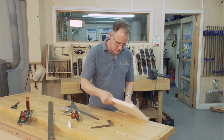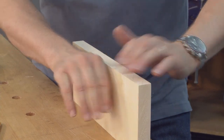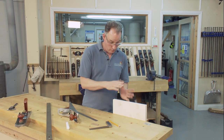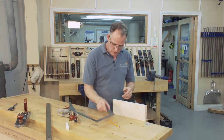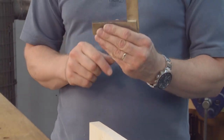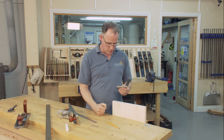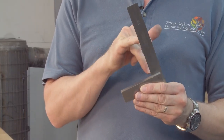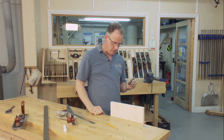So I'm going to set this up in the vice — that's now the right direction for me to plane and push those fibres down. I also need to see how square this edge is to my face side. I always use engineer's squares; they stay accurate for years and years. I don't find that wooden carpenter squares stay accurate for very long at all. I need to reference the stock of my square against my face side — that's always our reference or datum face to be working from.